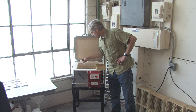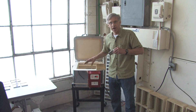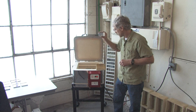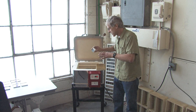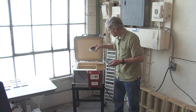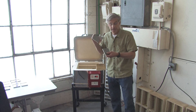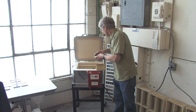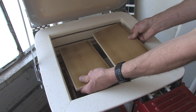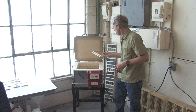Last night I fired — I needed to see one result on a 2x4 tile with a specific glaze and a specific program. I didn't want to dedicate an entire large kiln just to see what this glaze would look like on this tile, so I was able to use this kiln and it worked out perfectly. I put in a few other tests too. We can fit approximately three one-foot shelves stacked up and get a lot of volume, get a lot of tests done. We can also fire two 6x12s side by side — very handy, and not using up an entire large kiln.